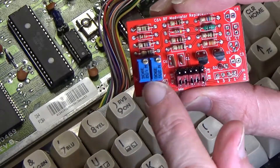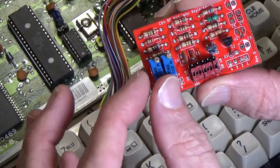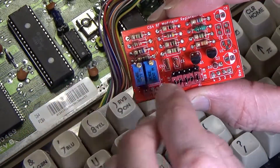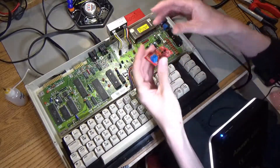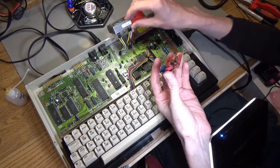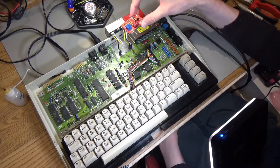The good thing about this is it's got these two little trimmer pots. Before I was putting a resistor inside the cable, but I've taken that out now and I've just got access to these two trimmer pots, which I've already trimmed. So because I've got it plugged in with these little fly leads, I can just swap between the two modulators dead easy. Spoiler alert — there isn't any difference.